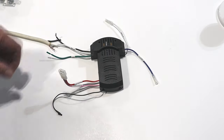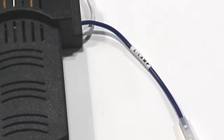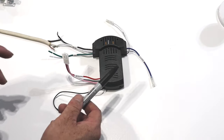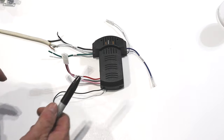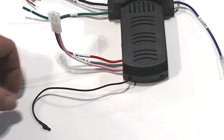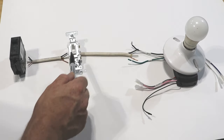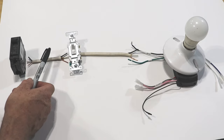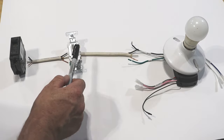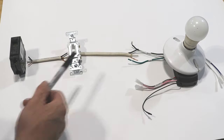You'll know that the supply wires need to be hooked up to the box. You'll also see that there are labels on the other wires, and they wouldn't hook up to anything on the supply side — those will be used to hook up the ceiling fan to the light. That goofy little wire is actually your antenna. Your switch will also be a 15-amp switch because the 14-gauge wire is rated for 15 amps, and then you'll have a box for your ceiling fan.